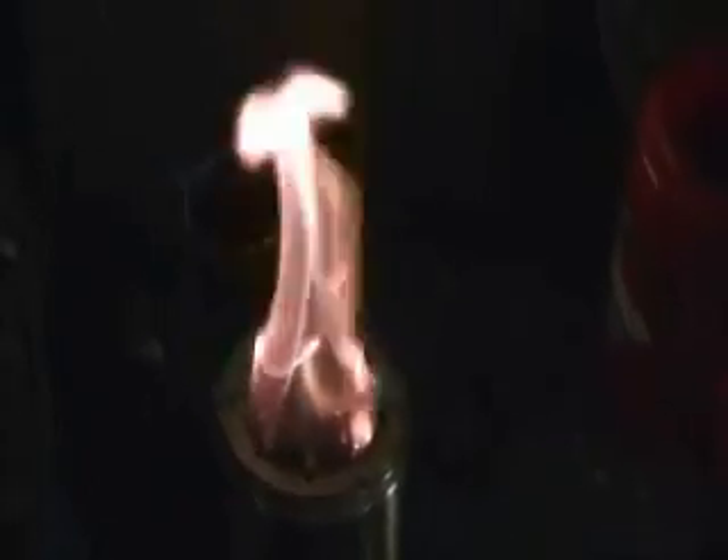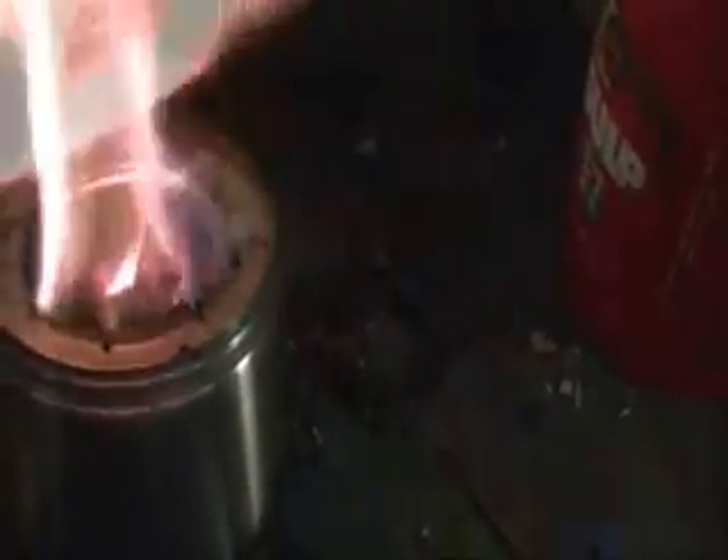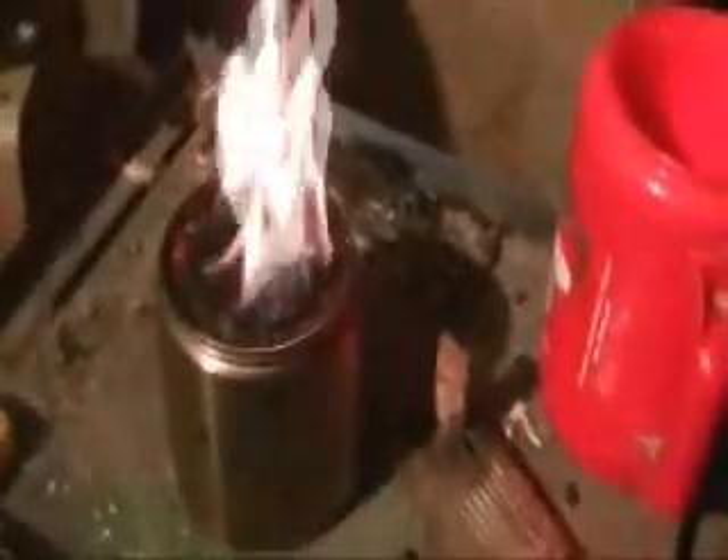This is my second burner and it is with pretty much hardwood fuel. You can see right there in front of my finger how those jets are working quite well. I need to make them bigger. So after this cools off I'm going to make those jets bigger, and I think that will help tremendously. I made some adjustments to my little coffee pot stove and there she goes — made a huge difference. Got a nice even flame now.